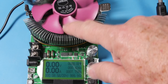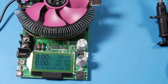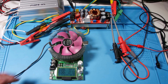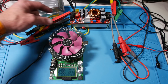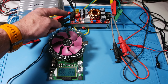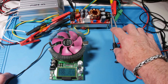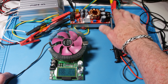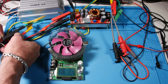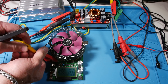Reading the manual, it sounds like this guy has variable fan speed, so it moves as much as it thinks it needs to to keep itself cool. I like that so it's just not running full blast all the time. So this is what we're going to do — use this power supply, put a load on it. The input is connected to my lab supply on the bench. I've got a times-one/times-ten scope probe going to scope channel one, set for the times-ten position, and over here I've got the differential probes going to the scope to look at the output.